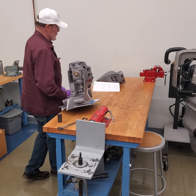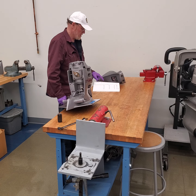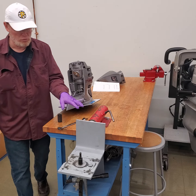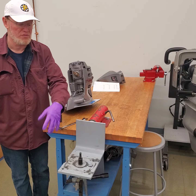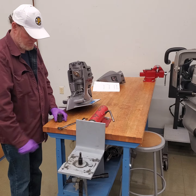There are two special tools you need right away. The upper head fixture is called the upper gear housing holder, part number 3856163. There are two versions — an older version and this newer version with multiple holes for multiple drives. The original holder only had four holes in it, but if you order a new one, you're going to get this design anyway.